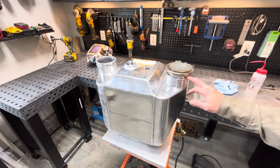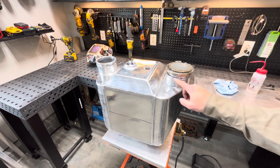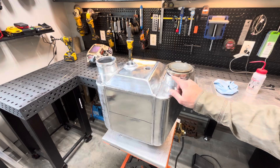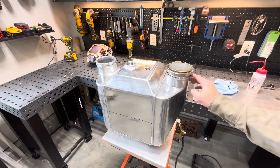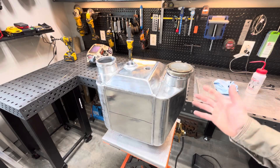I've wiped these down with acetone. They're not going to weld great — this is dirty cast, like I showed in the last video. We've got pretty big gaps through here, so we're just going to take our time and try to get this sealed up as nice as we can and go from there.